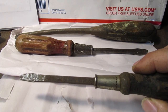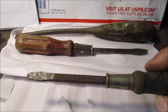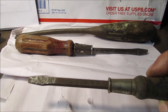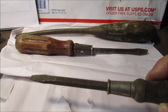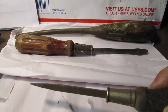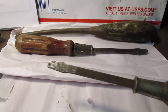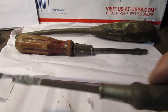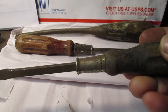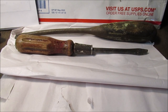It might be that oil treatment. I have a way to do it without having to worry about taking this apart. I just heat it with a torch, dump oil on it, and keep burning it. I was playing around doing it one day. Just kind of heat it, put the oil on it, and burn it, and smoke it. So we're going to experiment doing that. We want to put the color on it with burnt oil. We don't want it red hot. We just want to heat it and put oil on it. So we're going to figure out something on that, or gun bluing. I don't want that shiny. I think I want the look of steel and black paint.